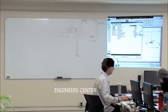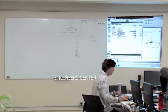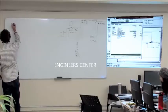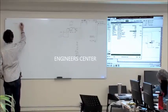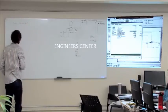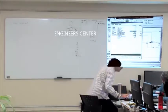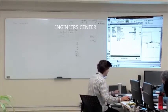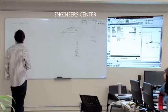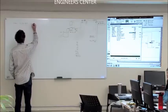Okay, so our mass flow rate there is 40,000 kilograms an hour. So number one is the diagram. Number two is what's the flow rate. That's the nominal flow rate. Now our rules of thumb would tell us that we need to add a little bit to that. So we might want to multiply that by 1.2. Our rules of thumb say to multiply 1.2 onto that, right?